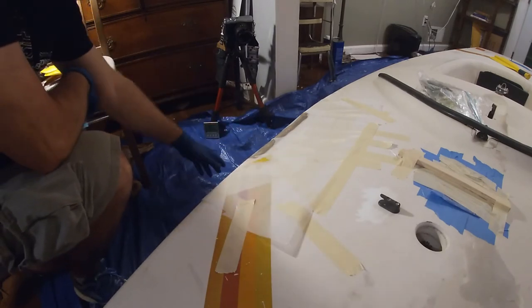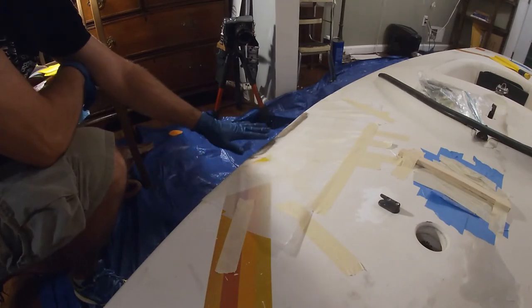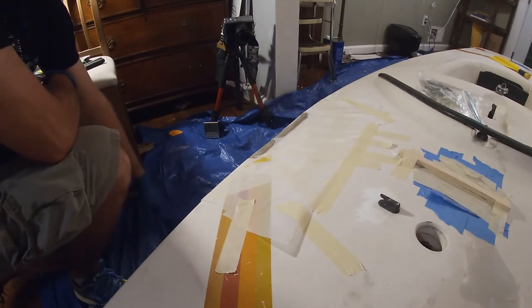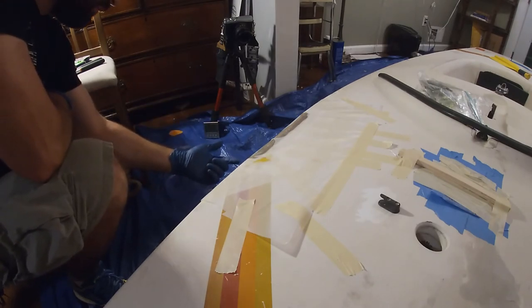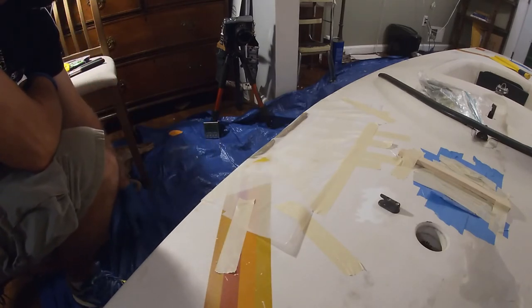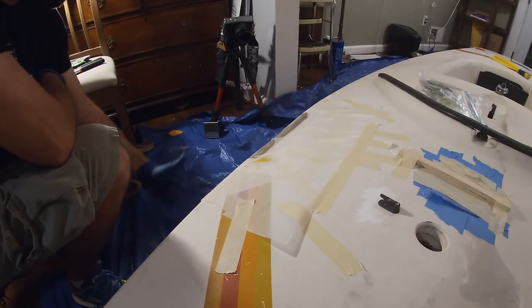That's all done — I think it was seven layers of glass with epoxy, then the peel ply on top of that, and then plastic on top. The plastic is not at all needed for the process — that's purely because I'm inside the house and I have cats who are absolutely going to find a way to walk over this if I don't cover it up somehow. So that'll just keep everything covered until it's cured and I don't have to worry about cleaning epoxy resin out of cat paws. We'll have this sit overnight and then tomorrow we'll take it outside so we can cut off the extra and start cleaning this up. That went pretty well — I had the whole thing laid up in pretty much 10 to 15 minutes. Tons of time to work with it, I didn't have to rush, no problems with anything setting up on me, so pretty happy with how that turned out so far.